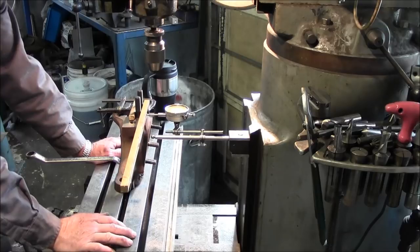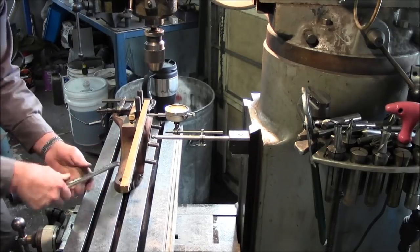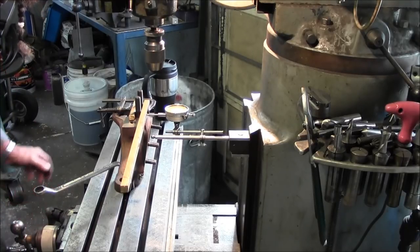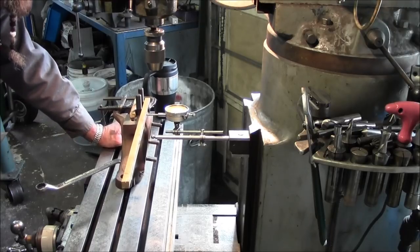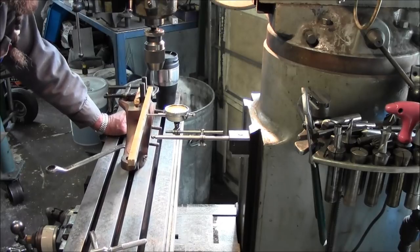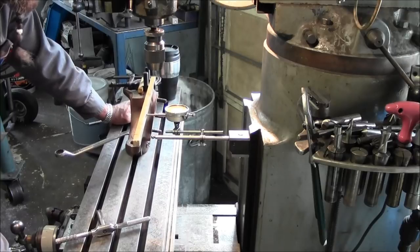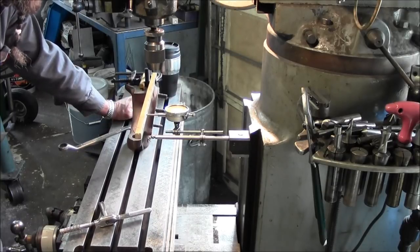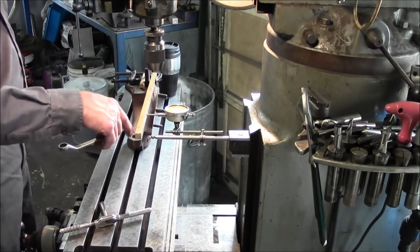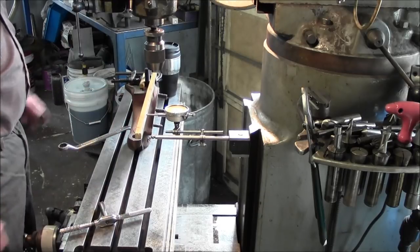Well, we probably would have never been able to do that again, but that is in a line right there. Alright, we're just going to verify it. We're going to put this right on zero there. It goes about a minus half, and now it's making us move back to zero, and about plus a quarter. So the trueness of this square, actually just going like this, I can make it go a half a thousandths, wiggling back and forth. Alright.